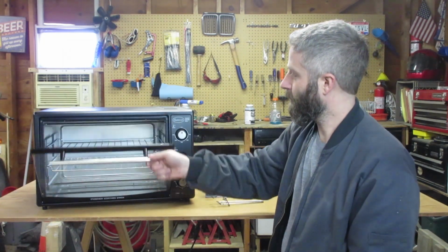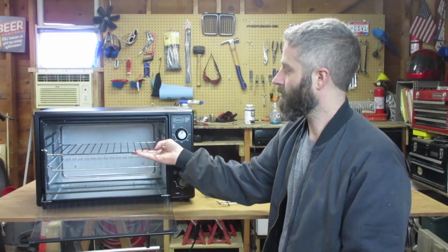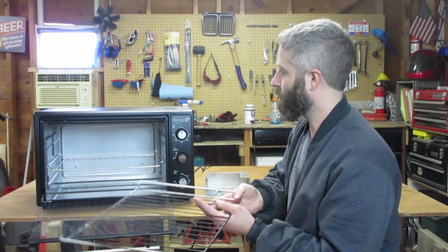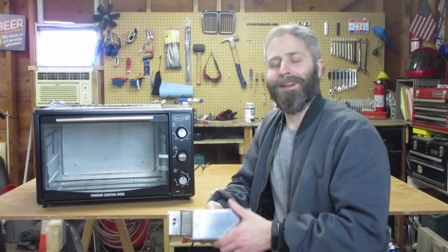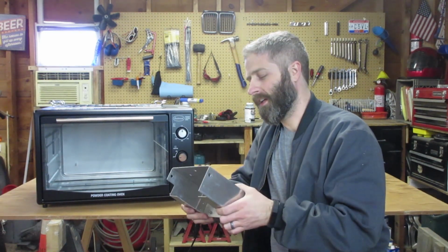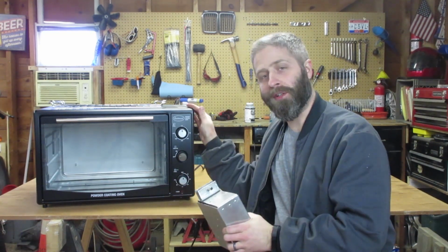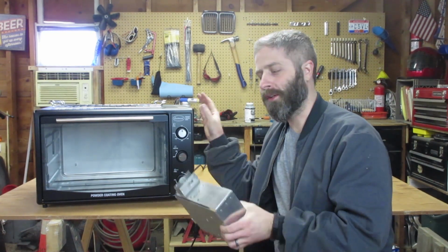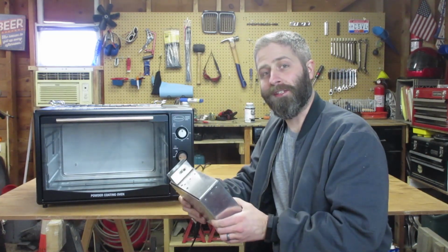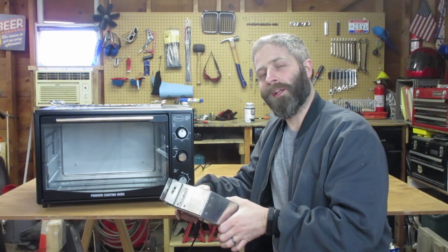When you pop the oven open, you've got 2 trays. What's this pre-baking I've been talking about? Well, pre-baking is essentially a final prep step where you turn your oven on, get it up to operating temperature, put your part in there to raise it to powder coating temperature without any powder coating on it. Well, why would I do that?